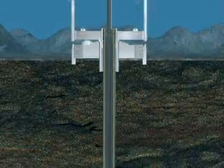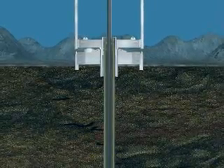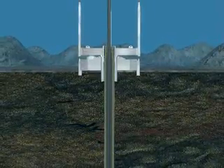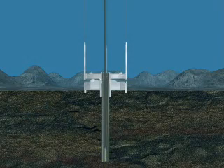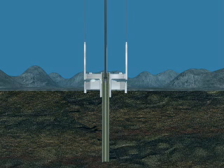Once the structural casing is jetted into place, the casing can be left to soak in place for a few hours. This allows the seabed formations time to expand and adhere to the casing. Verification of wellbore stability is accomplished by a gentle pulling and pushing of the drill pipe and running tool. After wellbore stability is verified, the running tool is released and the jetting assembly is retrieved.